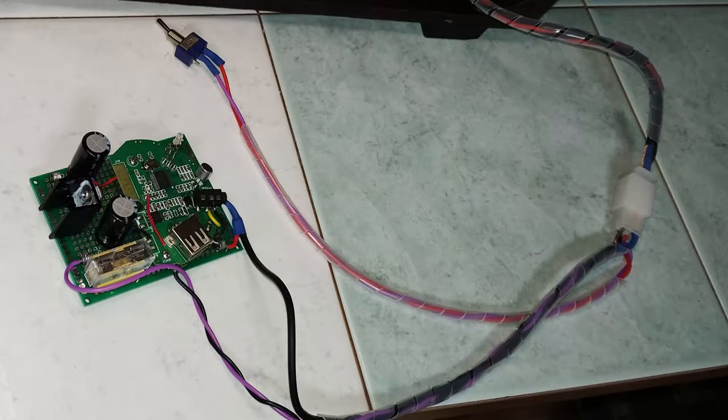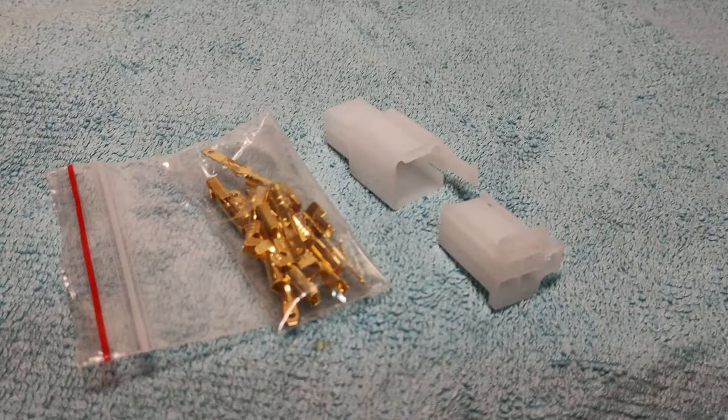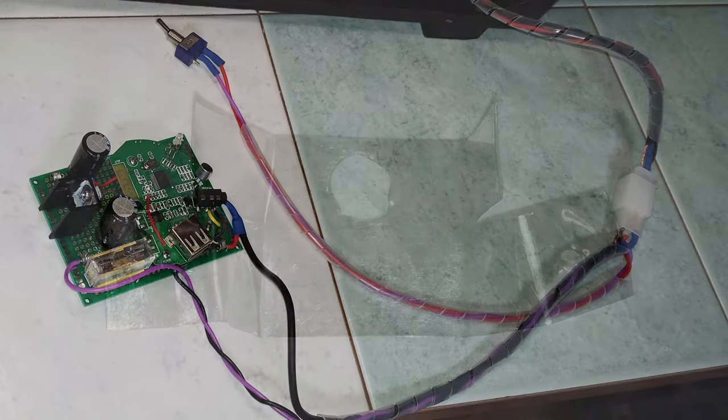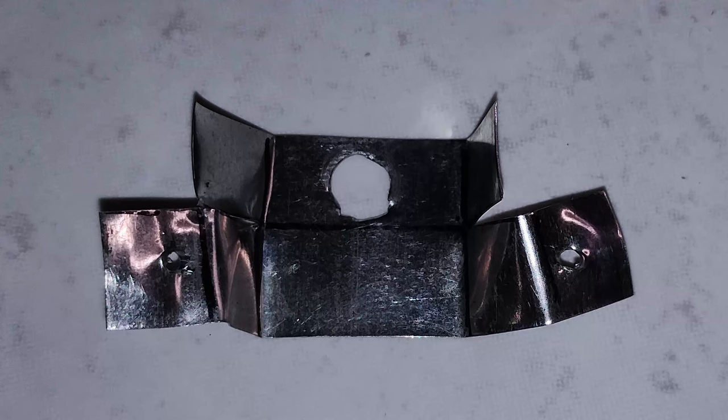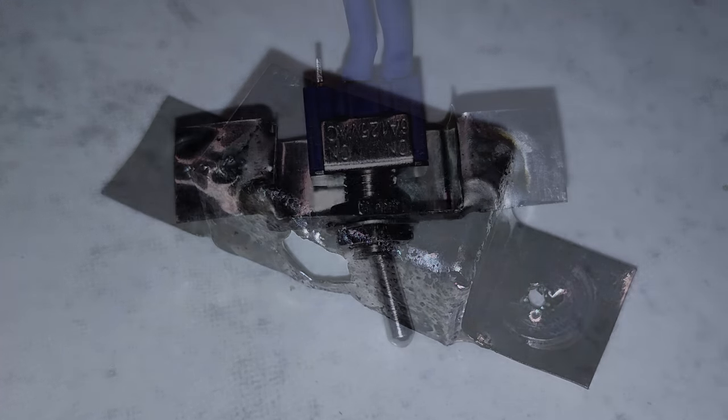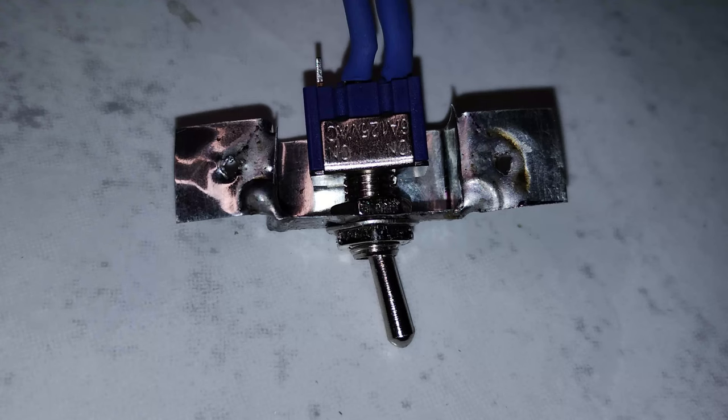To make sure that the Bluetooth module could be easily separable from the chassis, like for the loudspeakers, another 4-pin automotive spade connector was used. A sort of bracket was created to accommodate the switch that powers on the module. It is important to be able to turn off the Bluetooth module, otherwise, when not used, it would make noise perceivable while tuning to an AM station.